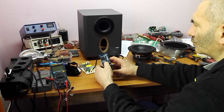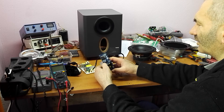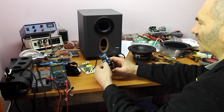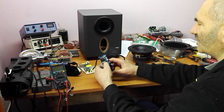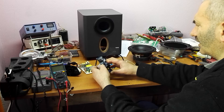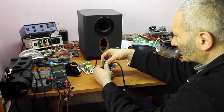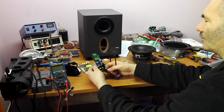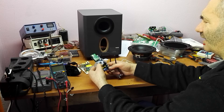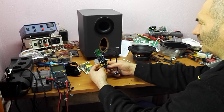I will also put the part number in the description. It's not just a simple amplifier — it's a sound processor with firmware, software, and I²C protocol for volume, tone control, and others. I realized it's too complicated to modify this original module to accept a simple wired audio input. It's impossible to attach a simple audio input for subwoofer use to this audio IC.